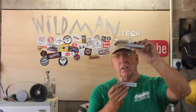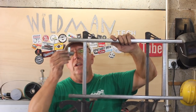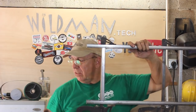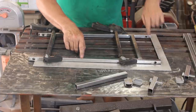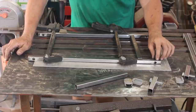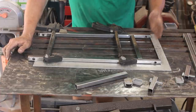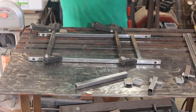Here are my sockets that are going to be welded onto the side of the hydraulic press. We'll take these frames, weld them together, and use the frame to actually locate these hangers on the hydraulic press. One thing I want to make sure of is that these holes are in the same place. I know they're in the same place relative to the end because I used my template to drill them all. Now I'll just use a framing square to make sure the ends are the same — this one looks good, ready to tack up.